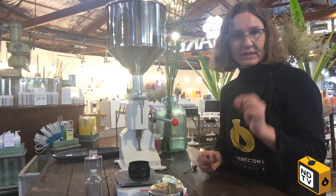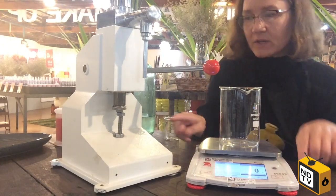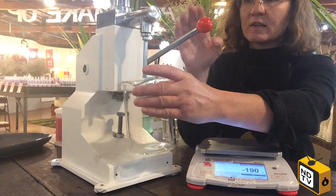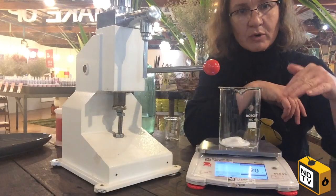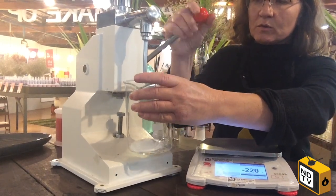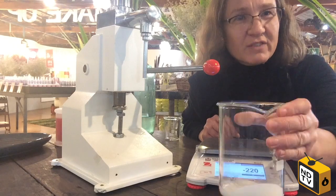The smallest amount is literally a couple of little drops. So we're over here by the filling machine now, and I'm going to show you what happens when you've got the movement restriction screw nearly all the way up. I'm going to lift the handle — as you notice, nothing's coming out the end yet. All the way up, then all the way down, and you can see immediately that you get quite a nice finish on the cream. On the scales, we're getting about 30 grams — I tared the weight back to zero and I'm getting 30 grams again.